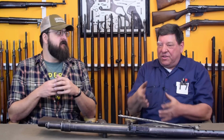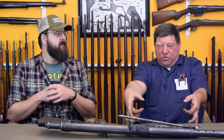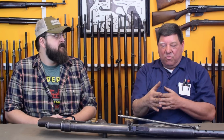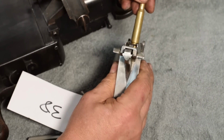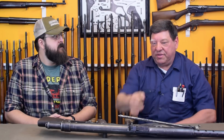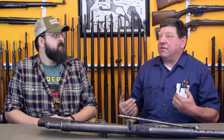You had a thing that you said comparing the '08 lock to the 1911. There has to be some slop in it or it won't work at all. But the '08 lock has the very same two mortises on the side and then a T-shaped rail that it runs in, just like a 1911, runs exactly the same way. And what'll happen is the top or the bottom, either the T or the rails, will wear. So when you've got a cartridge in that feed block running up and down, you've got this clamp in the back and the whole thing has the ability to move. All of the joints in the system are doing that. There's a lot of stuff going whir bang and piff inside that gun, and yet it really ran well.